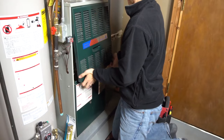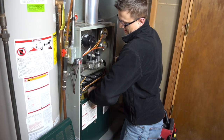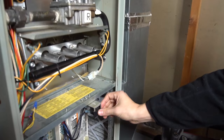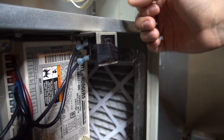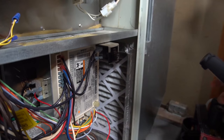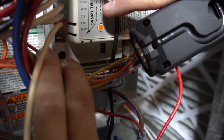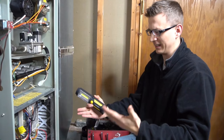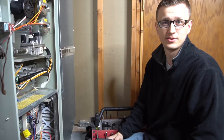So I'm going to go ahead and take my doors off and show you why I just said that. Here's my furnace power switch — it's off right now. Usually on most furnaces, there will be another switch called a door switch on the bottom door. And once you take that door off, this switch automatically pops open and interrupts the power. And if you had some kind of an error code blinking on your control board and you flipped your furnace power switch off or took the bottom door off, that error code will clear out. And if it's an intermittent problem, it might be a little hard to track down. But if you have a code, then you know where to start.